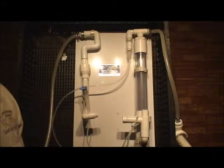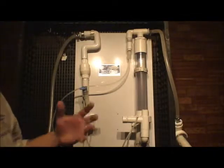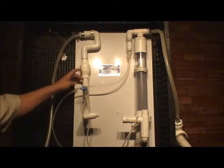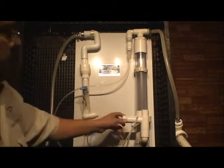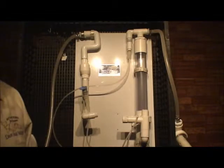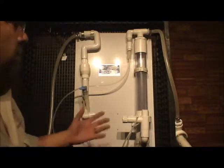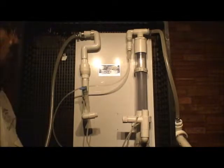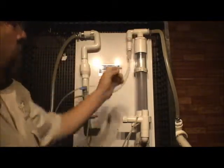As you can see, most of the fittings and connections are all male and female pipe threads, and these fittings, even on the end of these tubings, are designed for preventative maintenance purposes, to be able to take these fittings, tubings, or pump on and off without any significant issue. It's just real easy to do. If you need to work on your center tubing, you've got a fitting up here on top that you will remove, and right here you slip a quick disconnect coupling device to turn this and undo it, so that this whole assembly slides out.